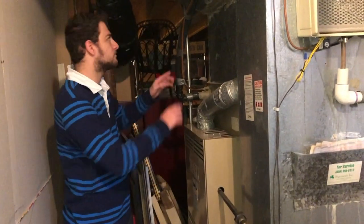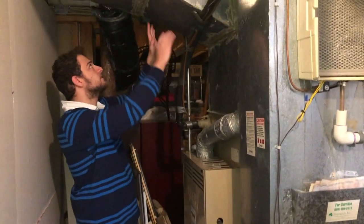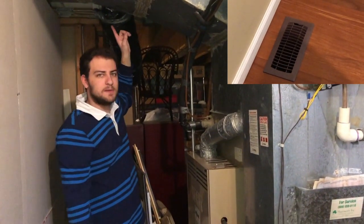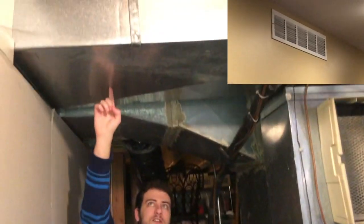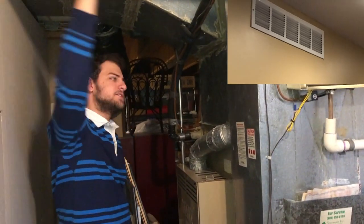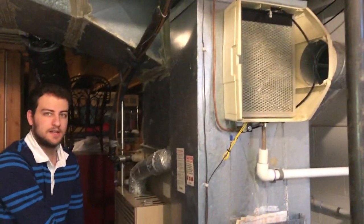And you can see there's some ductwork right here. This is the supply right here because it comes up right from the furnace and goes out to all these ducts through all the rooms right here, the upstairs bedroom, living room, the kitchen, and those come out the floor registers on the floor, and then this is the return on the ceiling, pulls the air out of the room, the cold air, and it filters it, goes back and forth through a cycle, and it pulls it down, and it gets sent back into the furnace to be reheated again, and that's how it is.